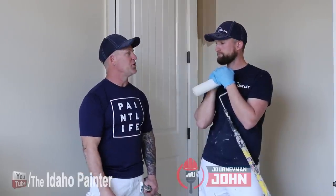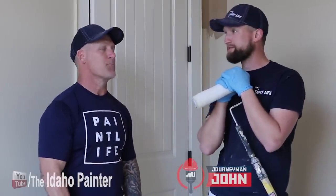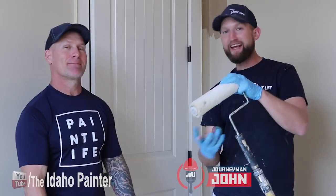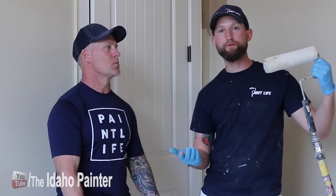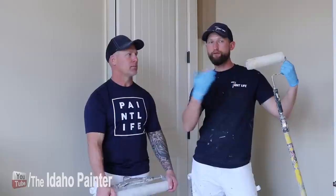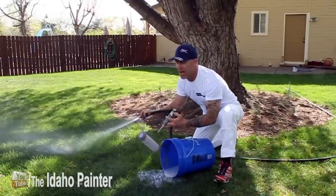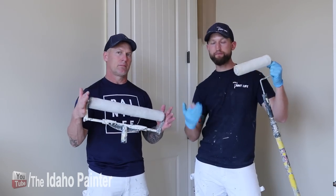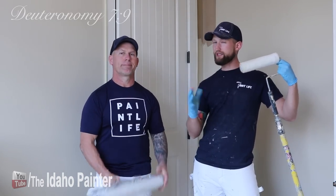So why would you choose a 9-inch? When it comes to it, I think about not just how fast am I rolling the room, but I also have to clean up. With a 9-inch roller, if I'm in a hurry and I need to get out, I can drop this in a bucket of water and clean it up at the end of the day. Not so with an 18 — I've got to wrap it in plastic, it's just more involved. When I do actually clean it, it takes about four times longer than it's going to take me to clean this thing out.